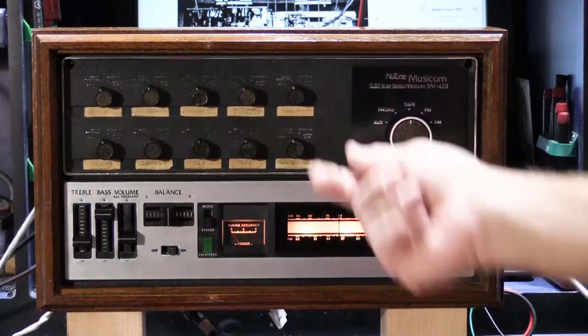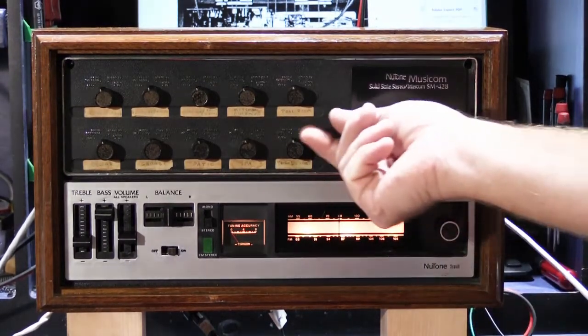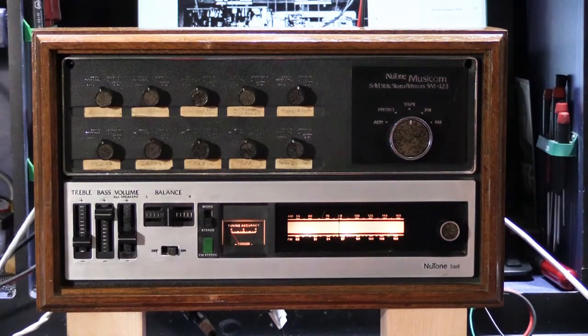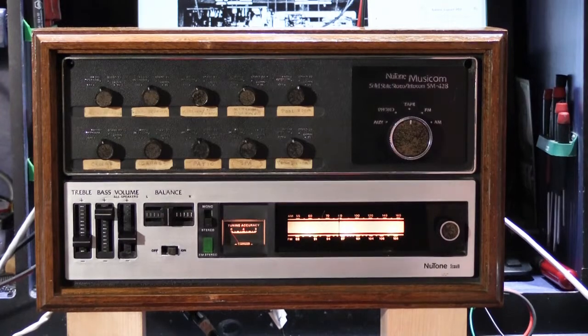You can turn it to radio and intercom, so you have both music and voice. You have standby. Standby is an old-fashioned labeling that goes all the way back to the 60s. Standby is basically intercom only. That standby was first used in the N25, 61, 62 systems, and it really means that you've turned the radio off in that room and you just have intercom functions.